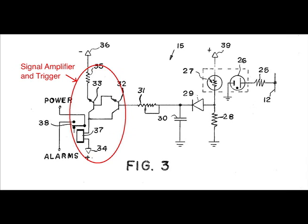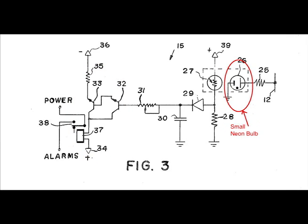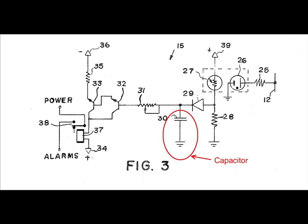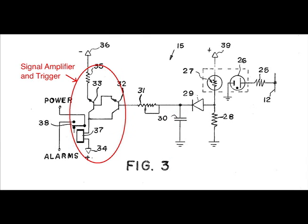The invention was needed at its time, and it used a neon tube — you can see where the neon tube is right here in the circuit diagram. The neon tube flashes every time the voltage hits it. Next to the neon tube is an optically sensitive photoresistor. This resistor detects the light flashing — the average pulse on electric fences is once a second. The rest of the circuit charges a capacitor and says yes, there's voltage on the fence. As long as that pulse keeps coming in on a regular basis, it says the fence is working properly.